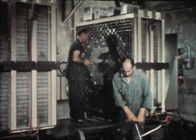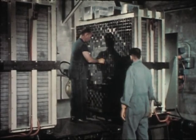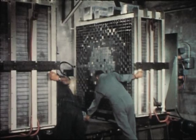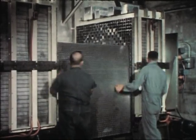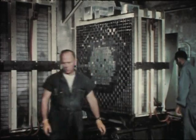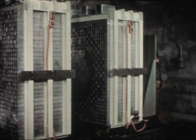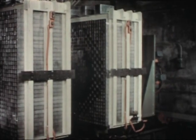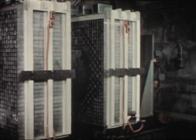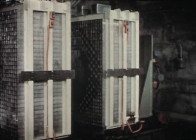Loaded according to the experimental program, these halves are then driven together to form a critical assembly. No coolant is provided; consequently, this reactor must be operated at low power. Determination of critical mass, flux distribution, control rod worth, and core arrangements has provided a whole range of experimental facts for application in any fast reactor system.